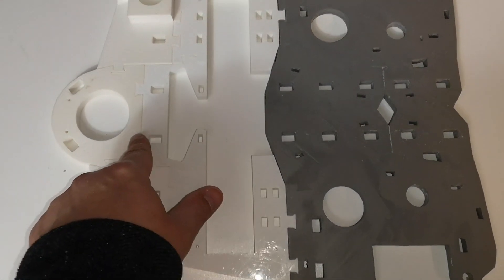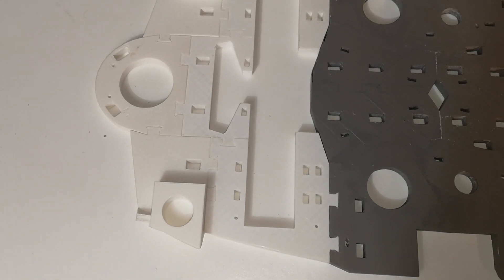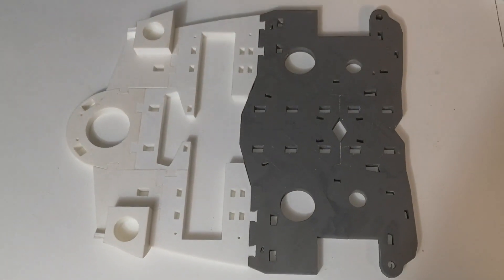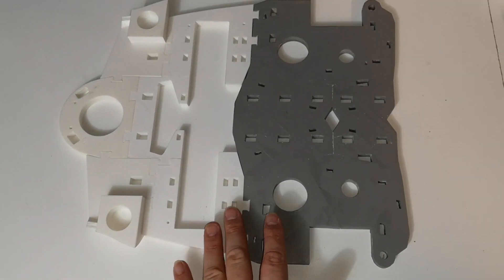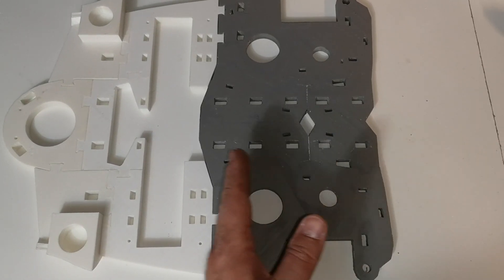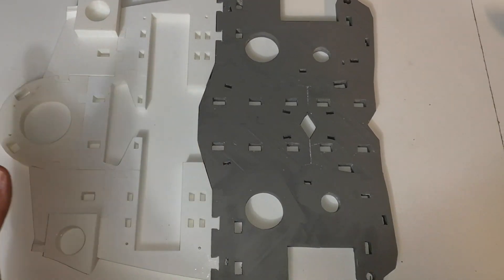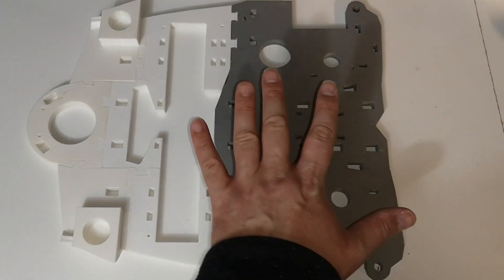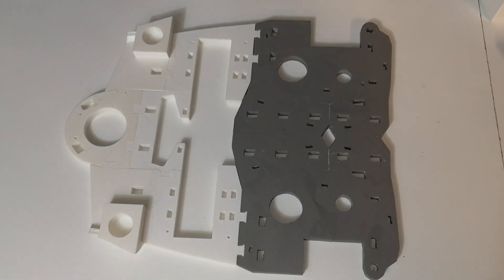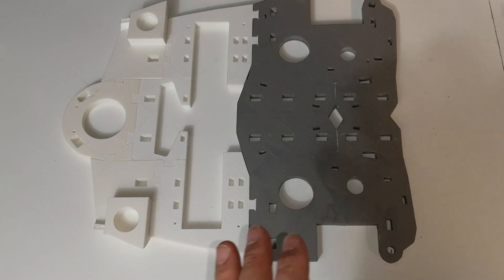So those joints are all connected — they were quite tricky, I had to do quite a bit of filing on them and I did tap them home with a hammer. But they're all in there and I'm quite pleased with that, they're nice and tight. In hindsight, if I was building the robot from scratch I would start with the torso and build this whole assembly first all in one go. The way I did it was to start at the top — as you can see it's two different colours — I went to this point, then a bit later added another row, and now we've added this last row. I think if building from scratch you'd build the whole torso first, then build outwards with the limbs and the head.